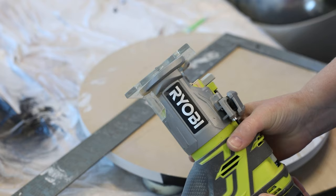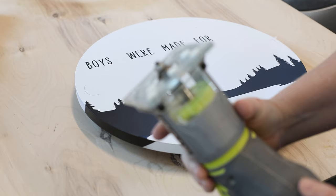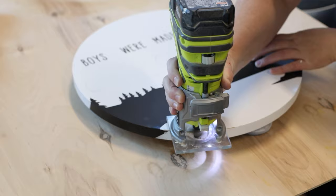The paint can be applied lightly with a brush but I decided to lightly spray paint it on. I used a router and a keyhole bit to make a hanger, then I used a chamfer bit to create a little detail around the edge — this is totally optional.